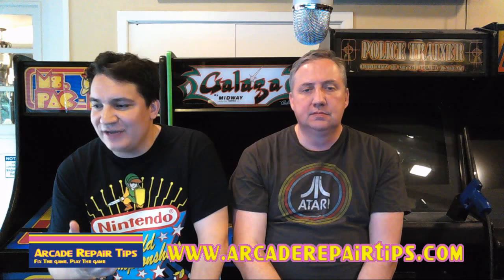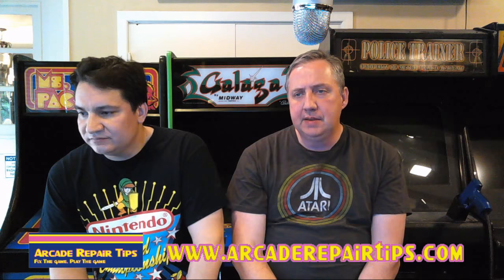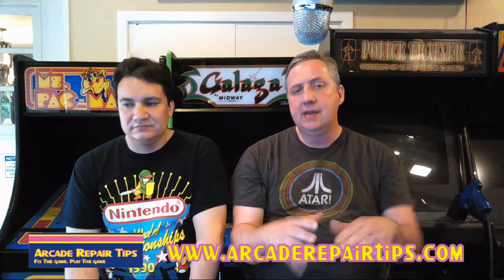Right. There you go. Silly Sausage 72 actually says, I think Bondo might work, which is what you mentioned, Tim. Will MDF soak up Bondo, making it swell? No, not really. I don't think so. I mean, we don't know how big a hole we're talking about here. Correct. At some point, I have literally had to heat up really high, let the laminate pull up, do a repair, and then re-glue the laminate. Gotcha. That may help too, because you can get to the wood that's under there and repair that in a bigger place.